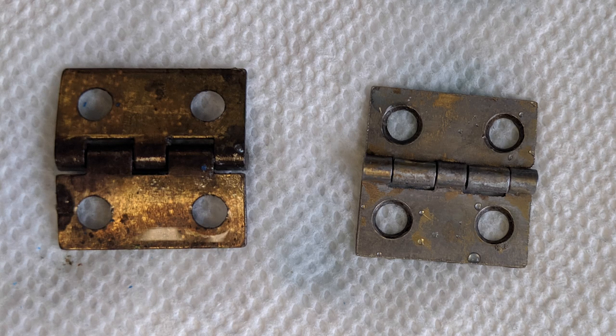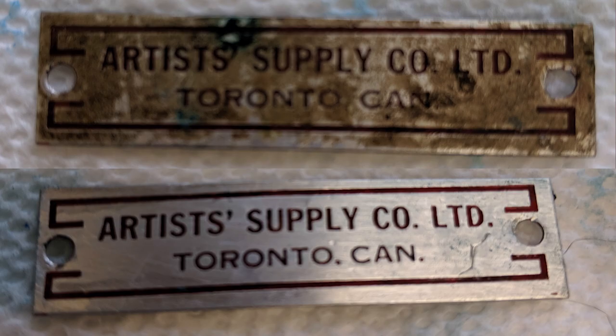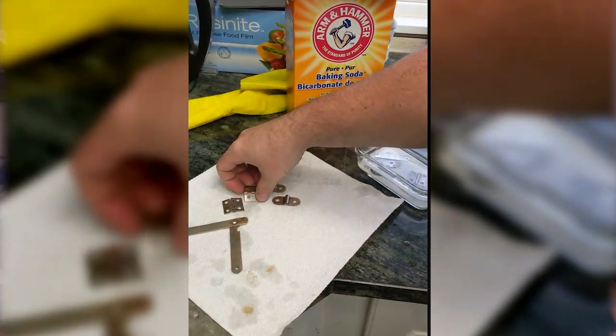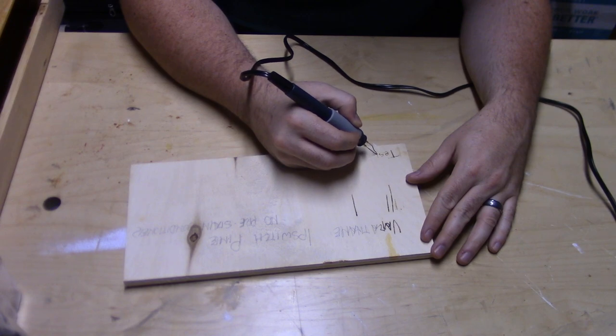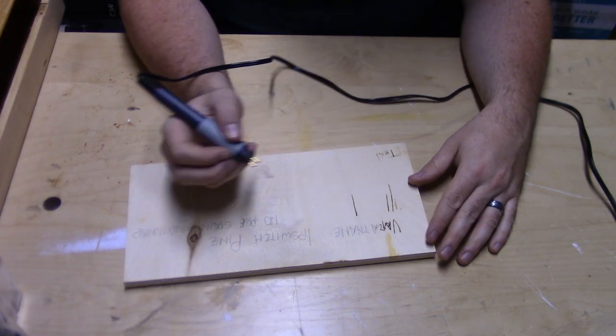She also took the old hardware and gave it all a vinegar bath to clean it up a bit. Then when I returned, I neutralized them in baking soda water and made sure that they were all dried off. With the wood parts all sanded and the hardware all cleaned up, I moved on to the first customization of this artist box restoration and broke out my new wood burning kit. To make sure I knew what I was doing, since I hadn't done this before, I tested it out on a stain sample that I had.